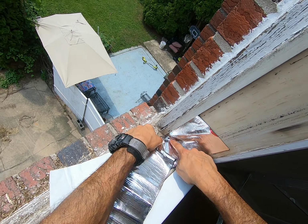Next, I use a Power Grab heavy duty adhesive that I'm going to put down on the bottom sill and all the way up the window, right on the corners where the window is going to butt to the trim. Before I do that, we're gonna go ahead and prep our window. So what I mean by prepping the window is getting the sashes out, getting everything ready. You always want to cut on the sides, not in the front or the back.